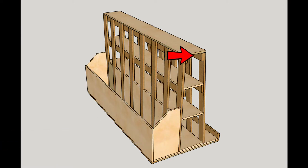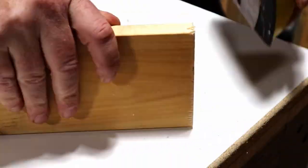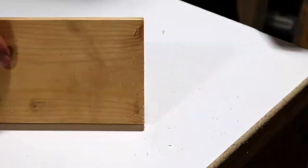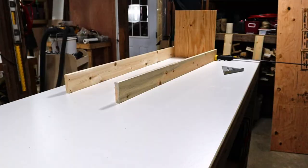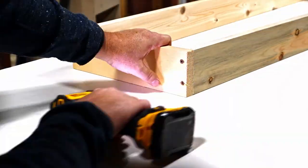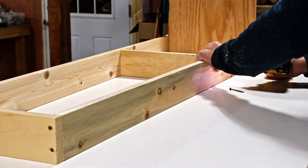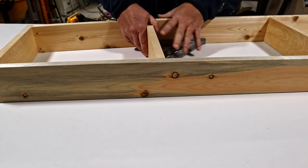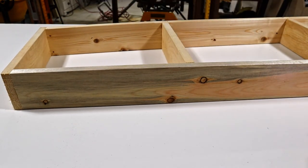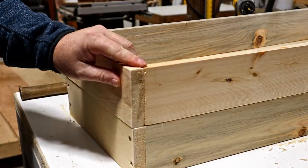The middle of the cart is going to be made from a series of A-frames that will connect to the base and will later be held together with plywood shelves. One side of the A-frames will be square with the base but the other side will have a slight angle of about 5 degrees. After cutting all the parts for the A-frames, I give them a quick sanding to remove all the tear-out left from the miter saw, and then I assemble the first one on the workbench. Once the first one is assembled, I use it as a guide to assemble all the others, just to make sure they're all the exact same size.